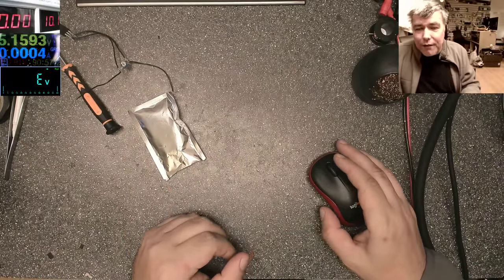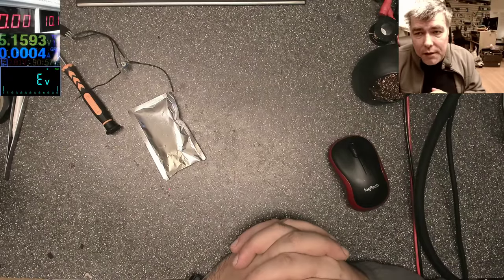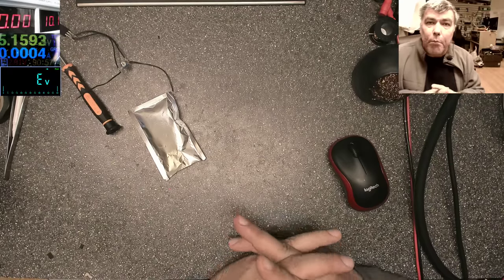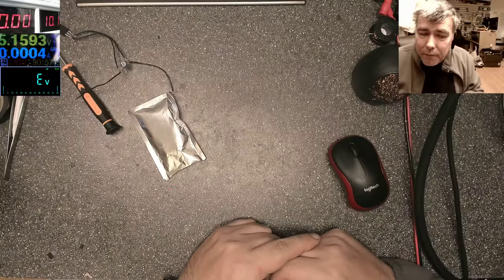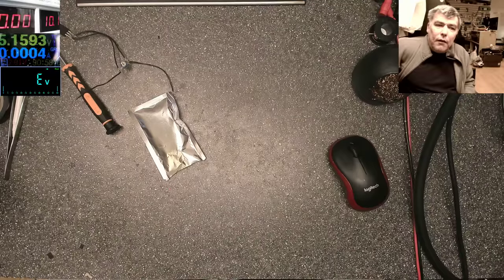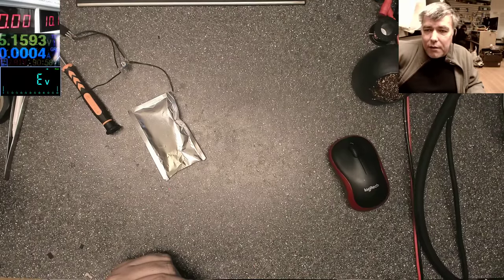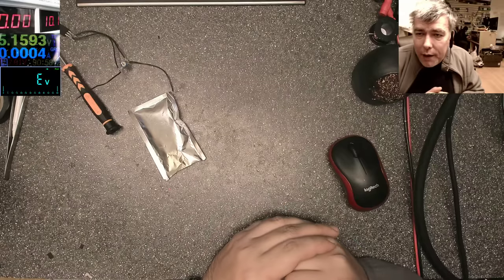You see how easily you can get tricked using the multimeter on the ohm mode. To be honest, in diode mode you can check resistance up to one kilohm. In the last five years, I haven't really found burned resistors — like a burned 100 kilohm resistor — because at that point you can only find out using the multimeter on ohm mode. Maybe on a power supply where voltage is very high you find high-value resistors in kilohms or megaohms. But otherwise no — I never look for burned resistors. That's why I use diode mode.